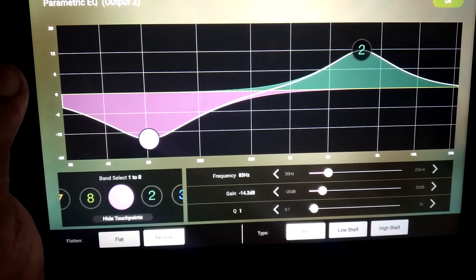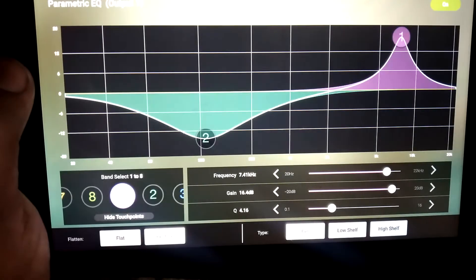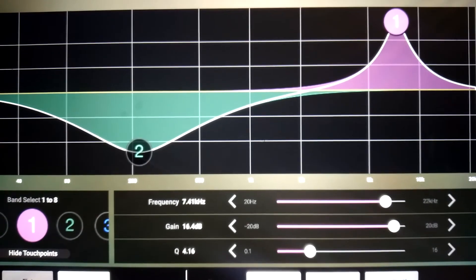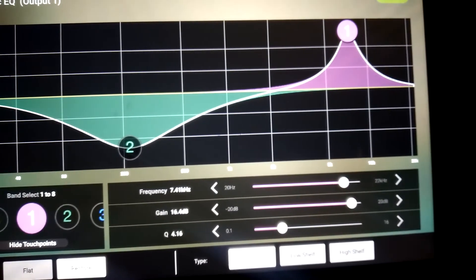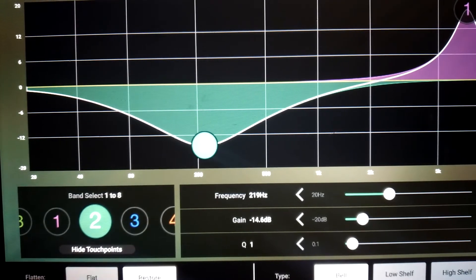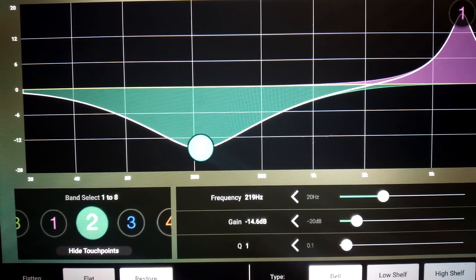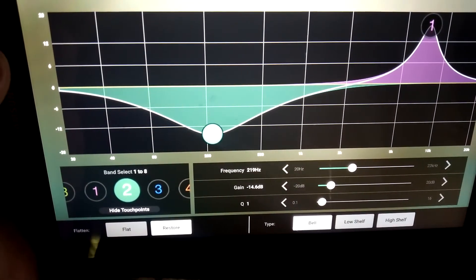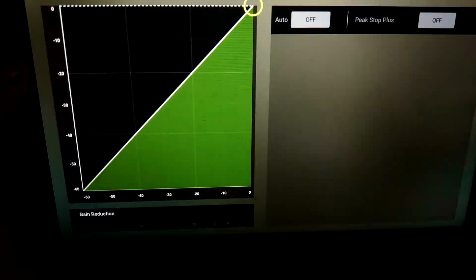Last is the horn — the horn driver. At 7.41 kHz there's a boost of 16.4 dB peak, with a Q of 4.16 on a bell. At 2.219 kHz they cut the frequency at negative 14.6 dB with a Q of 1, cutting sounds from the low frequency range down.